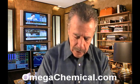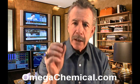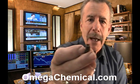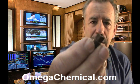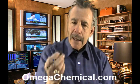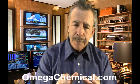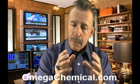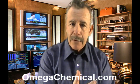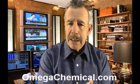In the old days we had what were called hydro injectors, and they had a little metering tip something like this. I'll hold it up — a little quarter-inch tip with an orifice in the end, and they're color coded. This one happens to be brown, and you knew once you had calibrated it that a brown tip would give you such and such a ratio — maybe 32 to 1, a red tip would give you 20 to 1, a black tip would give you 10 to 1.